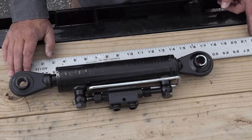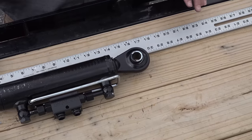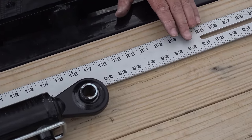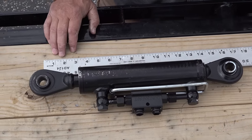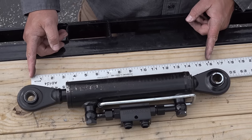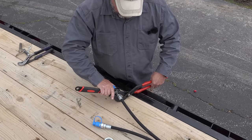When I ordered this one, fully extended it will be 22 and a half inches, and the one that came off the tractor was 24 and a quarter — so we've lost an inch and three quarters. In all my years using the tractor I've never extended a top link all the way out for any reason, and you're never going to collapse it all the way either — that's why it has such a range. This is going to be perfectly fine. The fact that this one collapses back down to 16 inches was actually my problem with the other one for the big tractor, which was about 19 inches fully collapsed — that three-inch difference made a difference.